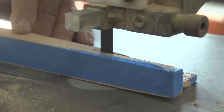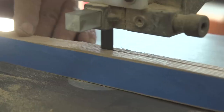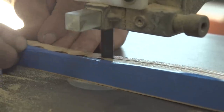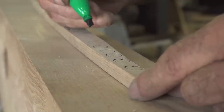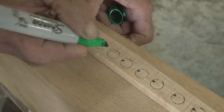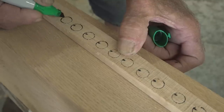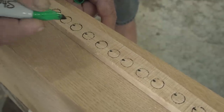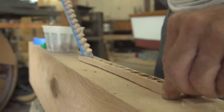I need a hundred plugs to do the boat, so I'll do it a few times. I'll do all the drilling first, then all the tape, then all the sanding, so I don't have to keep switching tasks. Before I pull the tape and pull all the plugs out, I'm going to make a little tiny dot right in line with the grain, because in a darker room it's hard to tell which way the grain is — the bandsaw cuts go across, so you can get them 90 degrees off really easily.